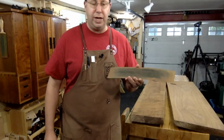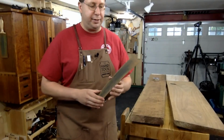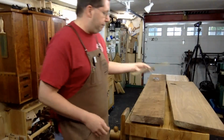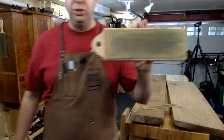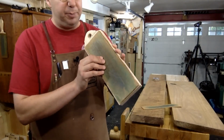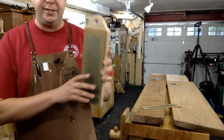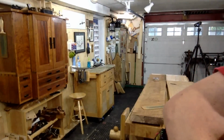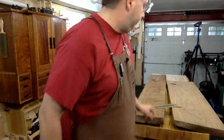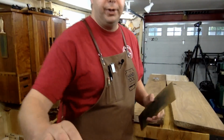The leather itself will do the job, but I do think the compound makes the job a little bit more aggressive. But I definitely keep that free for that reason. This particular strop is glued down, the rough side is up, it's a little bit more flexible. So I put it against a more solid hard maple surface. In general, the compound could go on either side, but I think the compound's going to stick to the rougher side a little bit more here.